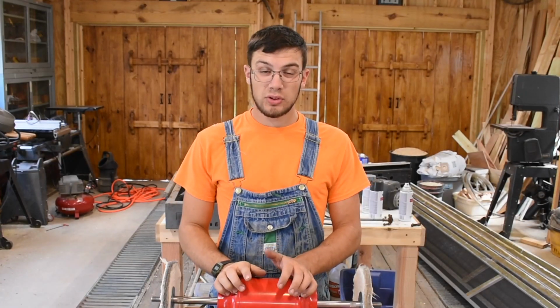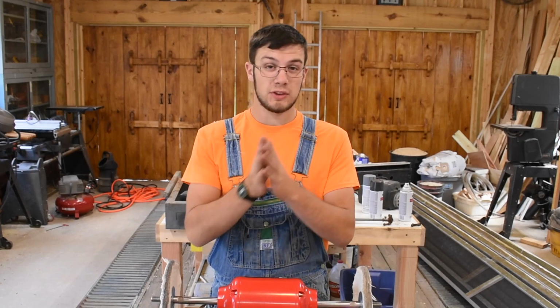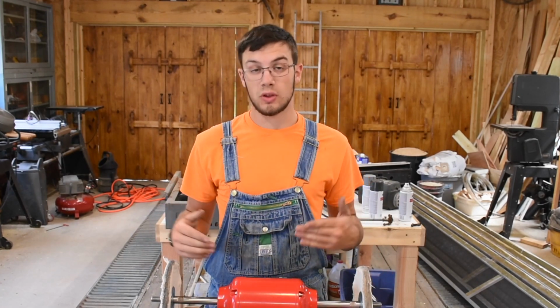So if you're doing knife handles, I wouldn't recommend using compound and then using steel and then doing wood, especially on a pale wood. This is super smooth, but it's dirty, so either you don't use compound at all, and then you can probably do both, or just have a clean wood wheel and a metal wheel. That's what I'll do. I'll probably be moving one of these, either stacking it or just taking it off and getting a new wheel that I'll do for wood.